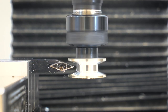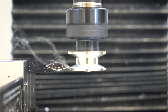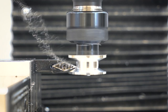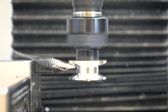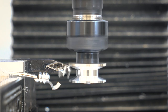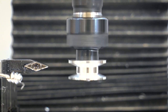At the very end in this last finishing pass, you can see there's an issue with the CAM. The tool kind of digs into the top of the pulley a little bit, and that's because I didn't enable 'no dragging' in the profile. Basically, when it's cutting in from the bottom it's cutting its own way in, but when it comes up through the top, that material hasn't yet been removed. So it drags the tool against material it's supposed to cut later. By turning on 'no dragging,' it skips that and comes in from the top instead and won't drag across the material — something to learn for next time.